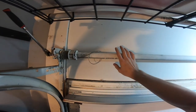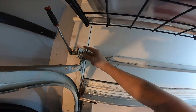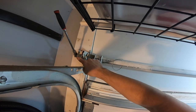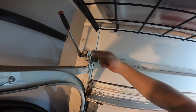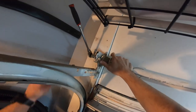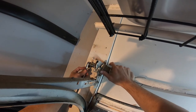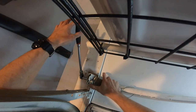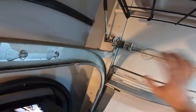My garage spring has been wound 16 times - 16 revolutions. So I know I'm going to have to turn this thing at least 16 times. I'll cut the video and unwind these. Here's one more time: all the way down, set the ratchet up, put some tension on it, hit the button, once it comes up let go. Just keep doing that until it's super loose, and do both sides.